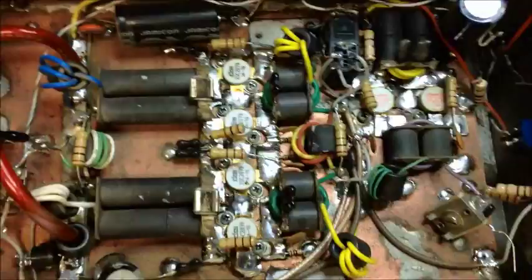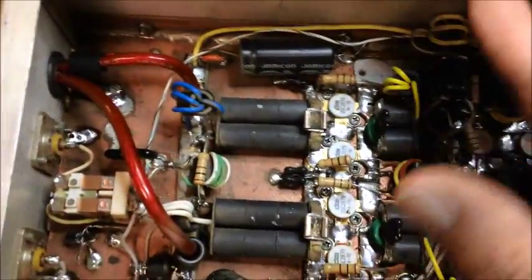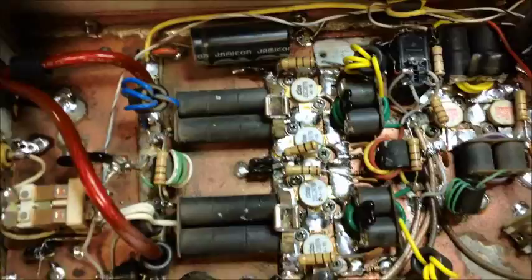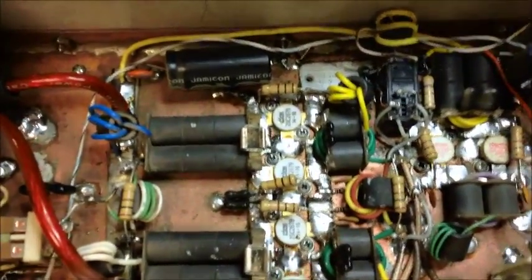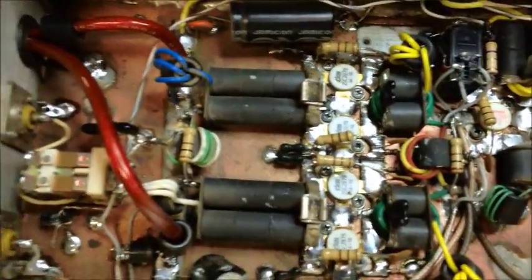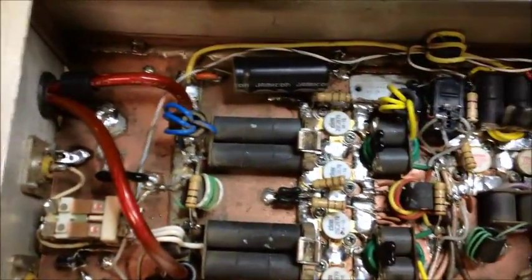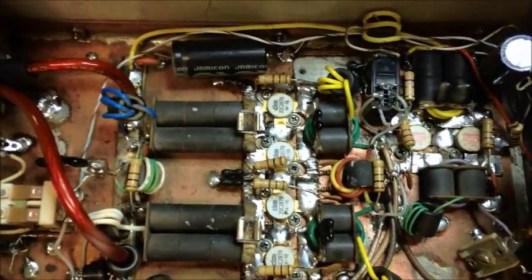Well, the thing it all boils down to, and most of the time when I tell the customer on the phone is, what you're really looking for is, if you're buying a driver box like what I use — I use this on my base station, it's a 2x4, I use it with my hi-fi stuff. Running hi-fi, you're not going to get all the watts out of it. The ticket here is how it drives my next amp that's in line. In all reality, I could care less if an amplifier is giving me 250 watts, clear all the way up to 500 watts, which I've seen out of this amp with various radios. What I want out of it is I want it to drive my amplifier. So regardless of what it does on its own, it's different than what it's going to do as a driver, and I explain this to people all the time.